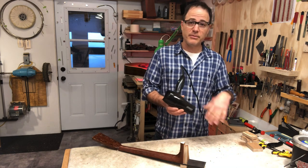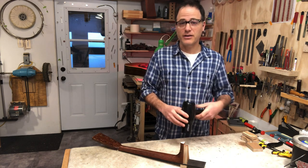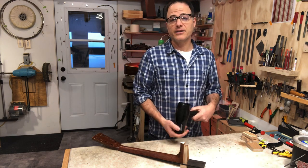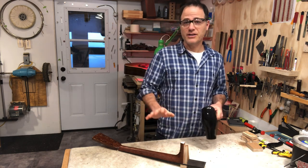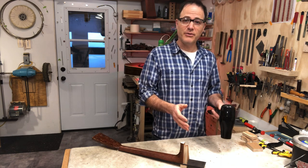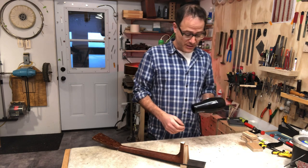When I do cleanup on the inside of a guitar, I use water to clean up all the squeeze-out hide glue, and then the hairdryer makes quick work of drying it. I can quickly see if I've done a good enough job cleaning. I don't want to leave any trace that I was in there — I like seeing a re-glued brace without much evidence that someone was in there before. It's a pretty handy tool.